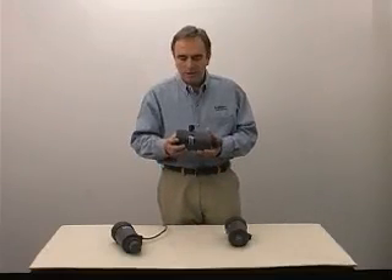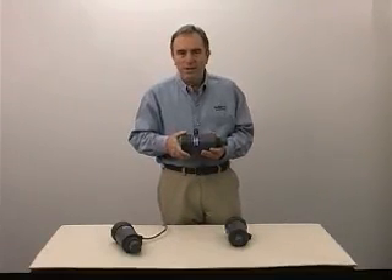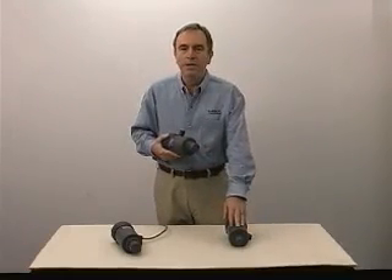The unit is completely made of PVC with a NEMA 4 housing. We have process connection sizes ranging from 1 inch NPT up to 3 inches NPT. The maximum range for this unit is 60 feet on the 3 inch NPT model.